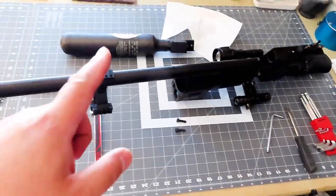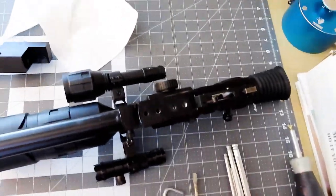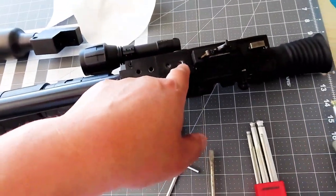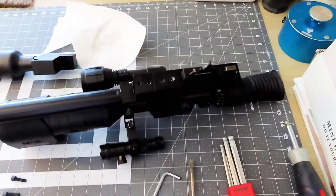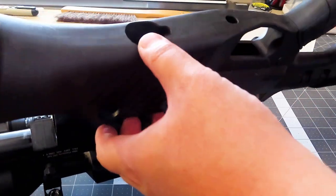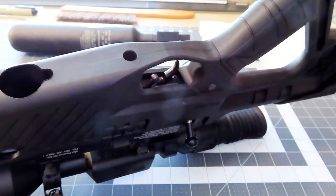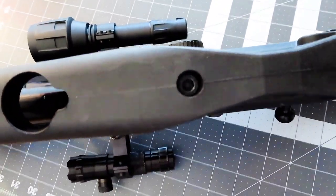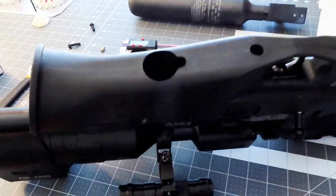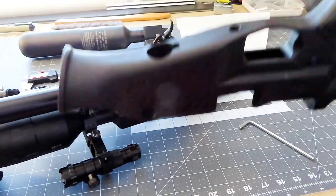So I have an air leak from a Hatsan Blitz. I went ahead and took the gun apart. I'll show you how to do it fairly quick. Somewhere in the bottom here. Wait, let me grab the other piece. So what I did is, very simply, when you put this back like that, there's an Allen wrench, this hole right here. You use a number 5 metric. You pull the bolt out, loosen the bolt, this whole thing comes apart. It's only held by one bolt, okay?